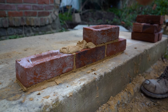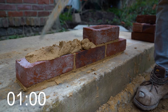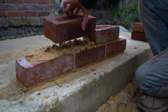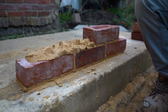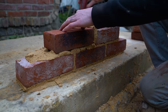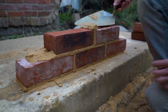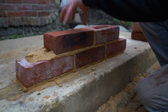Over here I'll lay another brick frog down. I've put the mortar down as normal and I'm ready to lay. Instead of placing it frog up, I'm going to butter it and lay it frog down. By the time you tap that down — can you tell me for certain that that frog is filled with mortar? Because I sure as hell can't. There's probably a little air pocket in there.